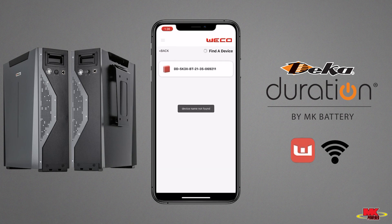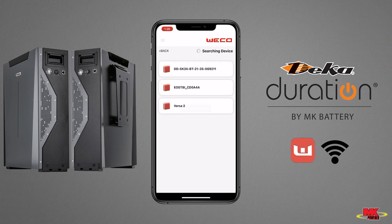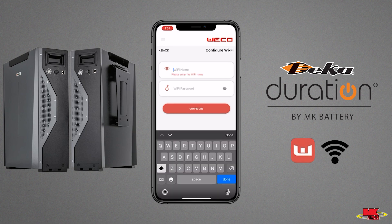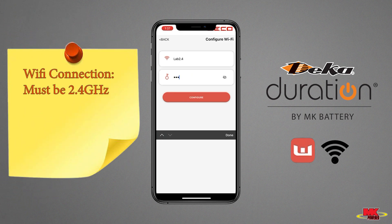Click on OK when prompted to configure Wi-Fi. If you are unable to proceed after clicking on the serial number, please go back to the main menu and click on Device List. Tap your master unit serial number and click on OK when prompted to configure Wi-Fi. Enter your Wi-Fi information, followed by Configure. Please note the Wi-Fi connection must be 2.4 gigahertz and your ping speed must be below 70ms.